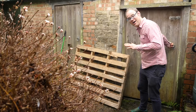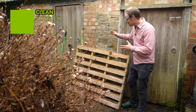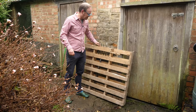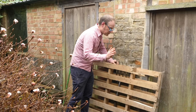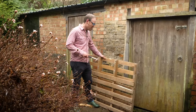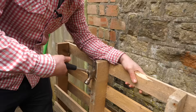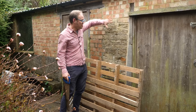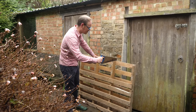To make our tool rack we're going to use a pallet — you want a nice clean one that's easy to work with. If I put a tool in like this, it's quite inconvenient to get at it, so I'm going to remove a couple of the horizontal boards to make it much easier to get them in and out. I'll use a hammer with some good hard heavy blows to get them off. Then level out the screws sticking out. This rack will sit on the interior wall, so I'm going to cut it flush against the upright to fit between the doors.